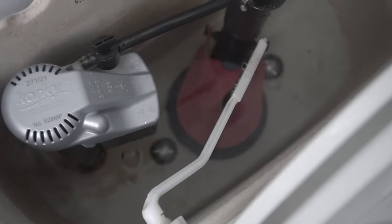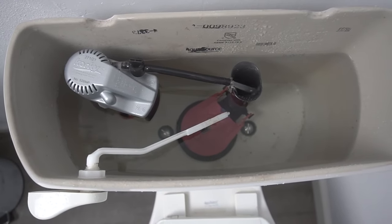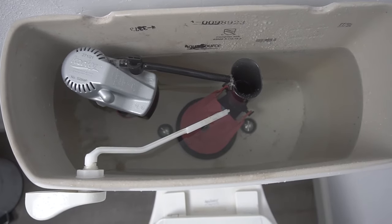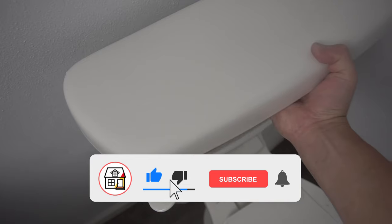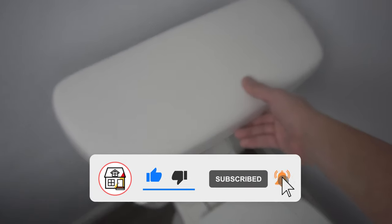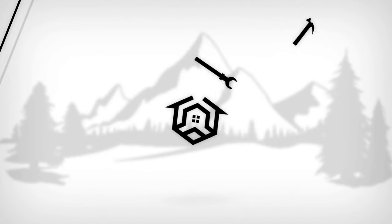Once you do that, test out the flusher to see if it's working nice and properly, and make sure the flapper stays down and is feeding water back to the flush valve tubing. Make sure you assess every single part of the toilet for leaks — if there are any, reverse engineer it and go back to where the water leak source is, because you might have cracked the porcelain or not tightened a part well enough. I hope you find this video helpful — if you did, please hit that big thumbs up, subscribe, and hit the notification bell so you can always be in tune with the DIY how-to videos and product reviews I do on this channel. I'll see you next time.